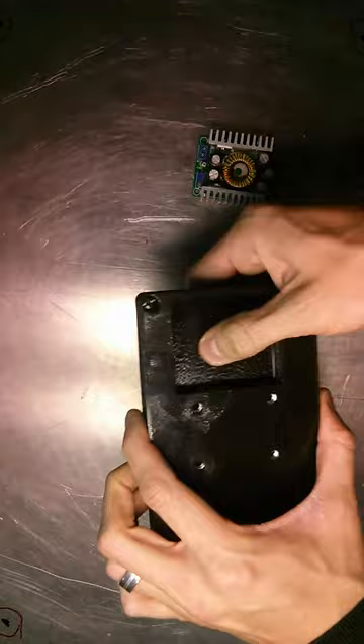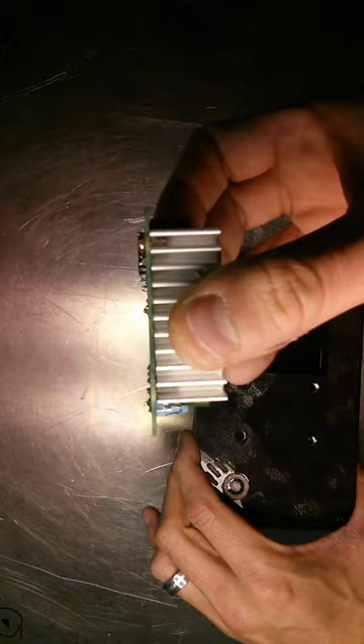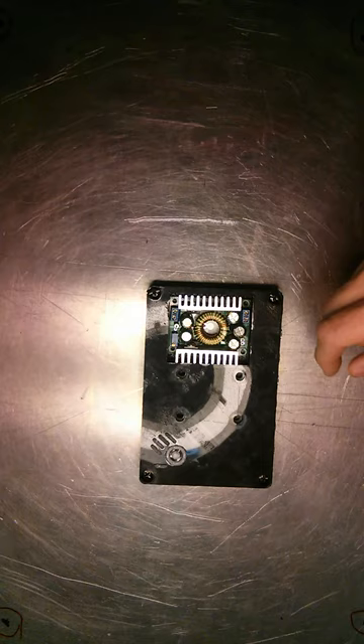The goal is to deform that PLA — I counted a couple of millimeters extra for this purpose. The goal is to deform the PLA just where those parts would ordinarily strike it, such that I get an extra three or four millimeters out of the height. Probably only maybe two millimeters off of the board, but the standoffs were about four millimeters high.